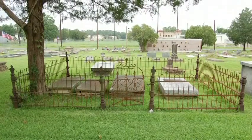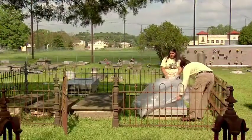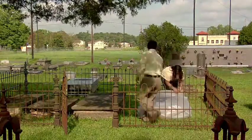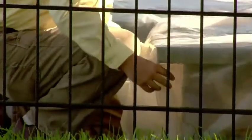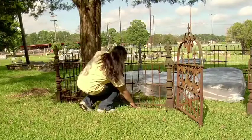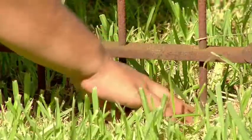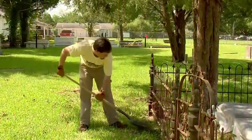Now that we have documented the project, the next step is to always cover up any objects in the area where the work will take place. It's particularly important to cover any stone grave markers as well as any stone or masonry curbing that may be under the ironwork. Rust, chemicals, and paint will all cause damage to the stone. Another important thing to check on the fence is that the bottoms of the iron panels are free from the ground. Only the corner posts and support brackets should be in direct contact with the soil. Any unnecessary ground contact will cause the iron to corrode. If the fence panels are in contact with the ground, they may need to be raised, or most likely the soil should be dug out from underneath them.